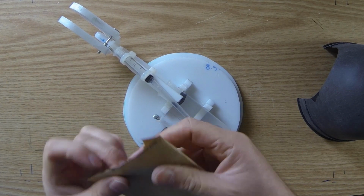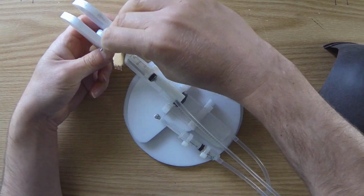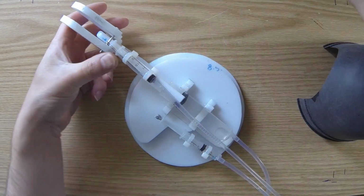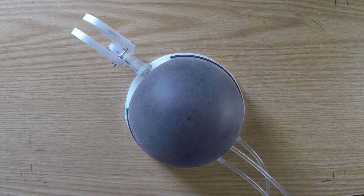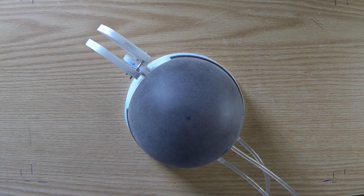Alternatively, I could remove some more material from the shell, but that is a lot more work and I'm pleased with the shape that it is currently. I could also try and remove the glue holding the big syringe to the saddles and adjust that 15mm gap we left to something like 17mm. There are a few options to try, but sanding down the syringe seems like the easiest.